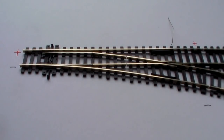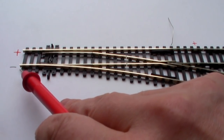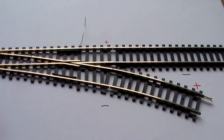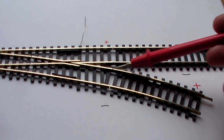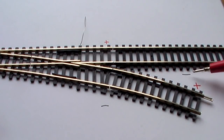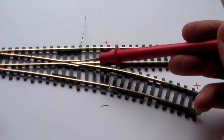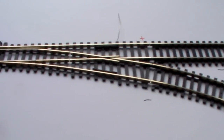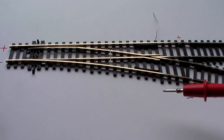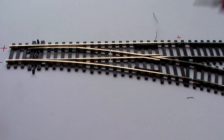Going back to our original wiring: we've got a positive supply running across the top rail and a negative supply continuing along the bottom rail into the siding. This track needs negative supply, and this one positive supply as it goes up and meets the top rail, with negative supply on the bottom. You can see the problem: positive and negative supplies would meet at the electrofrog - but the insulated rail joiners are in there to prevent a short. This gets over the problem of the plastic bit of rail, giving better smoother running to locomotives going over the point, particularly older and smaller ones. The issue is that the power supply to the frog needs to switch depending on which way the points are set.